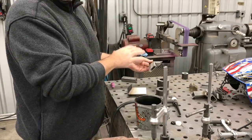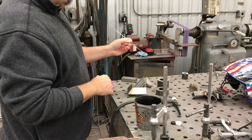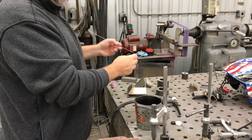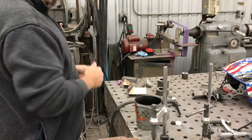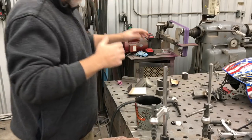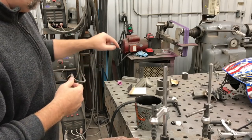The issue with this being too small — I don't have to worry about that on the big project because it's going to be a large, squared-off, basically eight by eight square, so it'll have some weight and mass to it and I can clamp the whole thing down. But I am going to make an effort to get this clamped when I weld the outside corner joint. If you do dip your rod and it sticks a little bit when you've got a little tiny piece, well, now you just move the piece around and you've kind of messed up your weld.